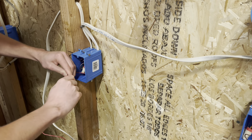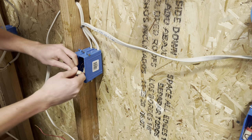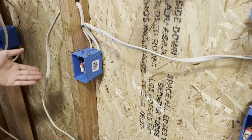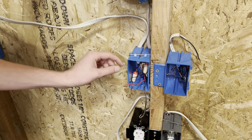The wires are a little long but once the wire nut is on it will be covered. Once these are tied together, this box is ready for your blank cover. Over on the switch side, you are going to reuse your ground — don't touch that, and don't touch your neutral.